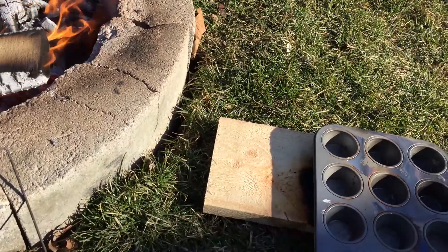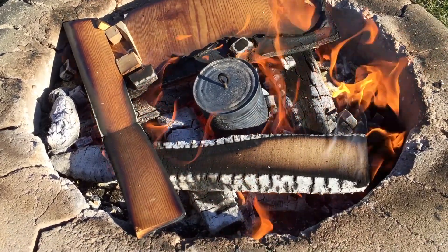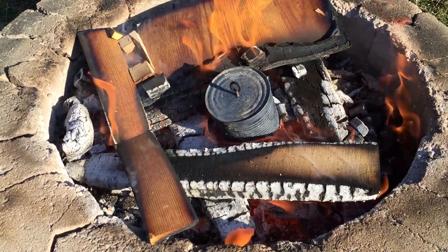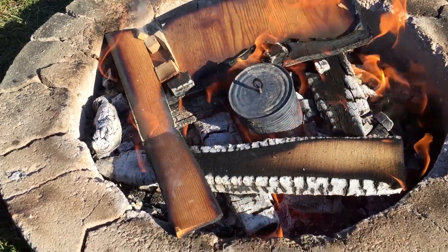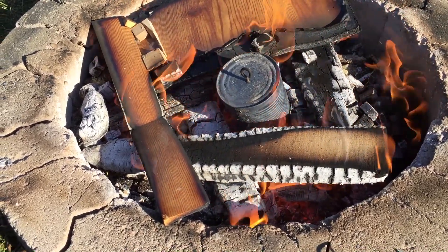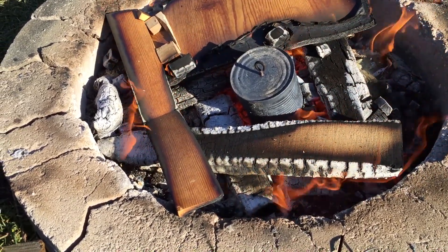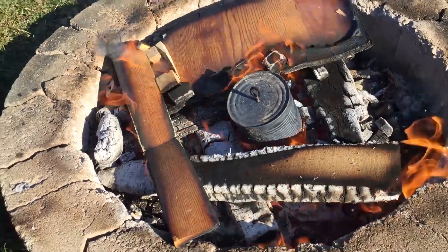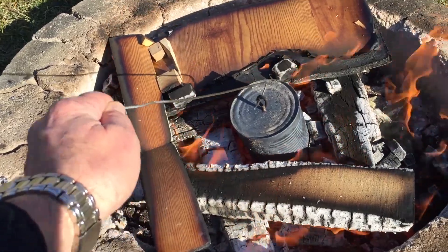The extra overpour piece that was laying on the wood — we threw it back in the can. We have a fairly heavy steel can that the aluminum sits in, and a larger can that fits over top of it as a lid. I found just experimenting with this before that if you have a lid over top it really helps hold the heat in, otherwise the heat dissipates so fast. The campfire temperature is so close to the melting point that it takes a very long time without a lid.